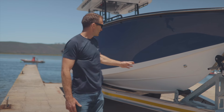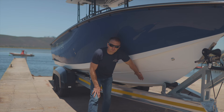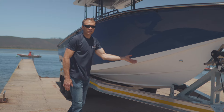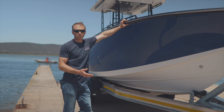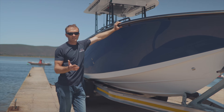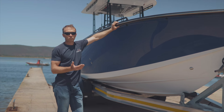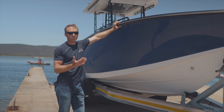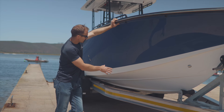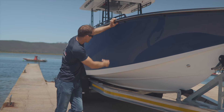All the panels on the boat are convex — a rounded shape that reduces impact when you slam on the water. Think of airplane design: the bottom of the plane is always rounded so that when they land on water in an emergency, it minimizes the impact. We've gone with rounded panels up front in the bow, all the way up to below the waterline.